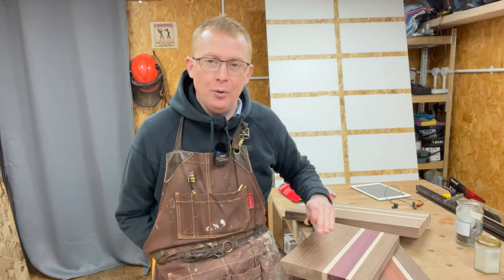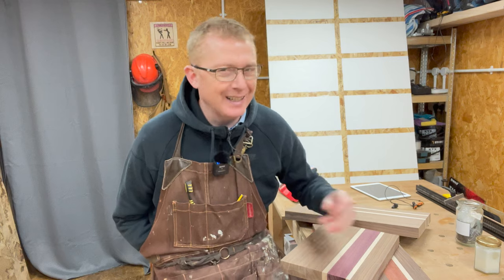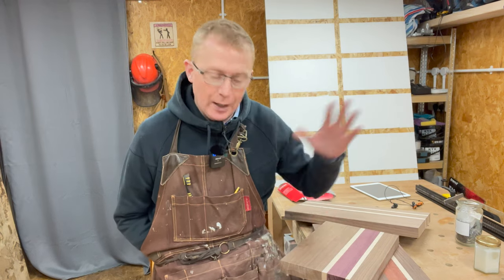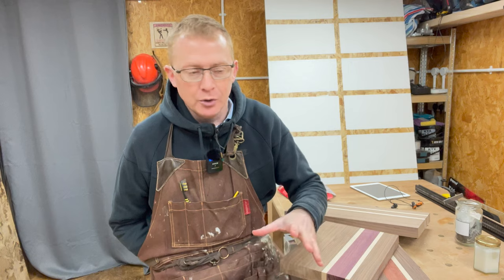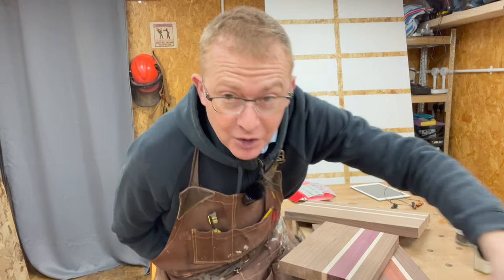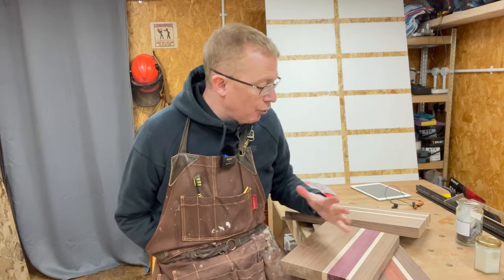And I would recommend putting them on because you don't really want it lying flat, soaking in water, that kind of thing, not ideal. And then for finish, you need to soak them in mineral oil, get as much in as you can, and then wipe off any excess. And you don't have to buy the fancy butcher's block oil stuff. I got this off Amazon, and it wasn't expensive. It was actually probably cheaper than buying a little one with a fancy branded name on it.